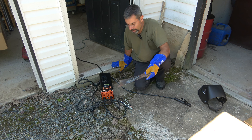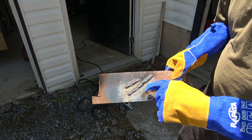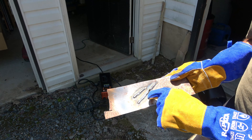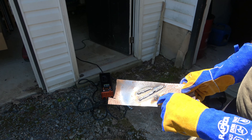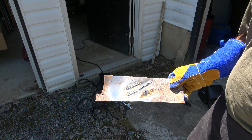It's actually really nice. I burned through a little spot there, but you can see that's really like a sixteenth of an inch maybe. And look at that nice bead — it laid a really nice bead both times. I had started over here with the helmet on and didn't see the rust that was still over there, but once I got into the clean polished area it did really nice work. I'm so much better with a stick welder than I am with flux core, and it shows. I remember how to lay a bead — my automotive instructor back when I was a teen taught me how to work with a stick welder, so that's about all I ever did.